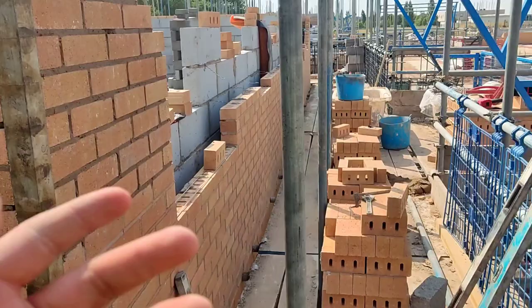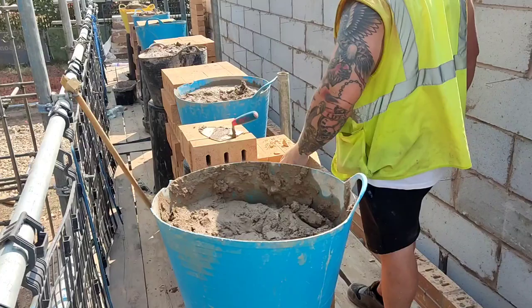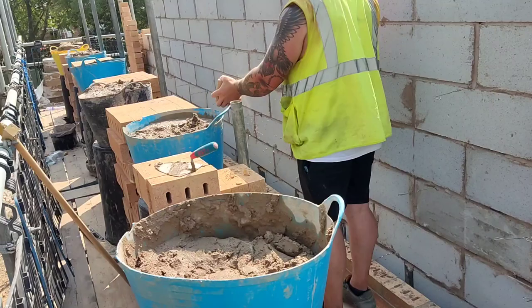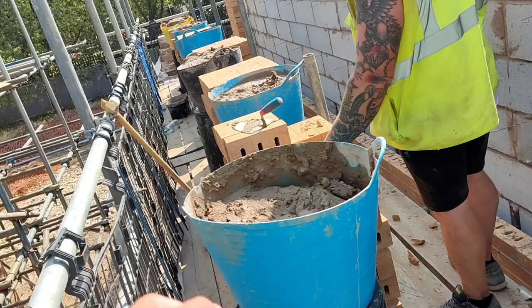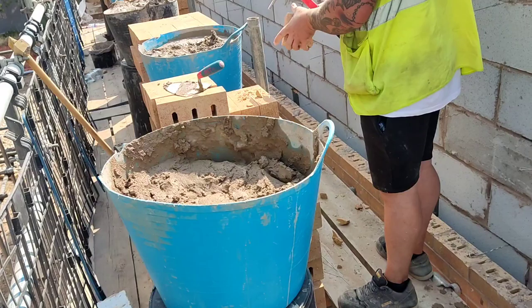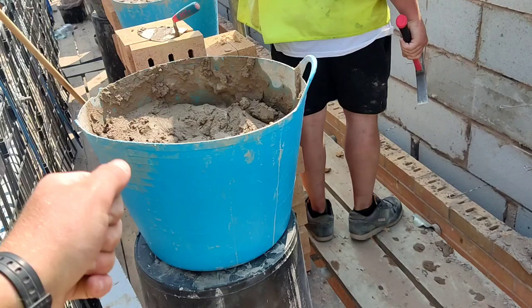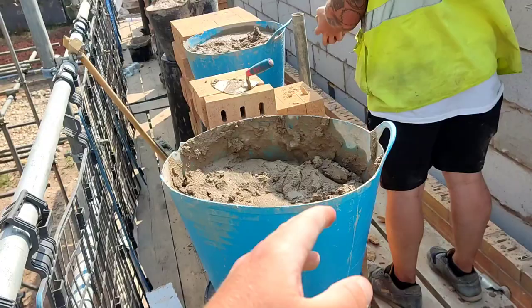And then, obviously, people say, what about winter? Well, by winter, we'll be on silo, and you know silo doesn't have a retarder in to stop the chemical reaction. So everyone knows if you put some nice wet silo mix, say you're doing some patching with, it'll stay wet for hours in a gorilla tub. And they're so easy to knock up as well. Even if someone says, oh, the last bit at the bottom, you can't get it out, you can. Might need a bit of drizzle on it for one of your tenders, labourers, improvers, whatever who's helping you. And then, once you've mixed it about with the tile setter, still an English style trowel, just smaller, you empty that gorilla tub, with the few dregs in, into your one next to it, which hopefully isn't as empty, and then you refill it.